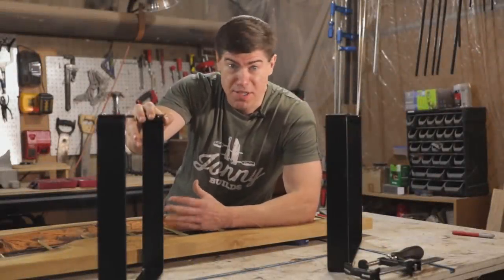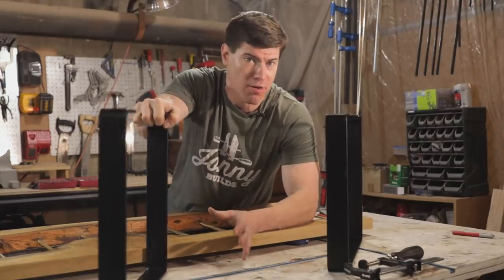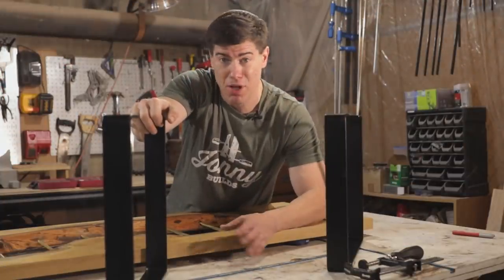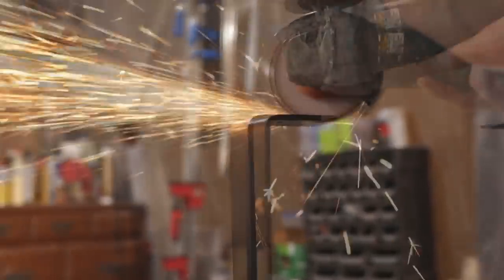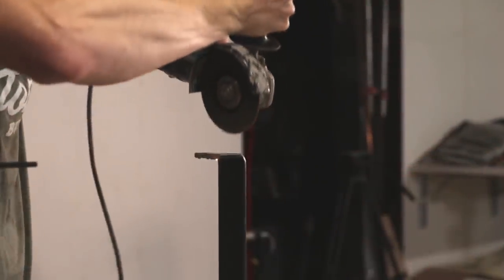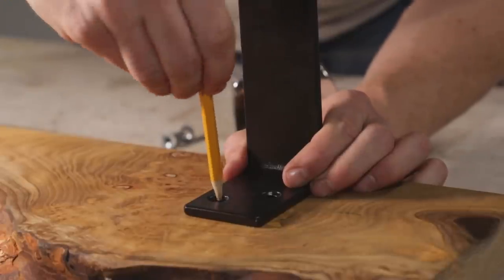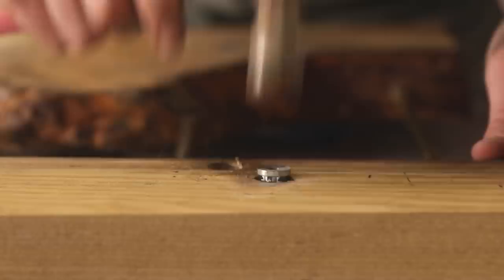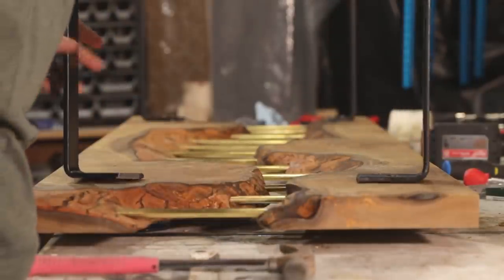A lot of you out there don't have the ability to weld in your shop, and actually I don't right now either. So I decided to order some prefabricated legs from a place called Outlaw Woodcraft on Etsy. I found out after I put the order in that they are a subscriber to this channel — so show them some love, I'll put a link in the description if you need steel legs for any of your projects. When I ordered the legs it didn't quite measure accurately, and one of the legs had a little overhang that would have extended into the river. So I went back with my angle grinder and trimmed that off, which also meant I needed to re-drill the holes for the quarter-inch screws in that leg. To attach the table legs I initially used some hammer-in threaded inserts, but I don't recommend these because they actually started pulling out later. So off camera I had to go back and replace those with inserts that have threads on the outside to secure them in the underside of the slab.